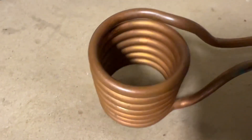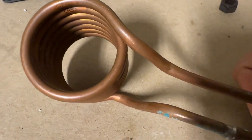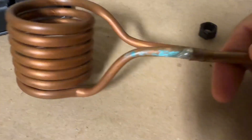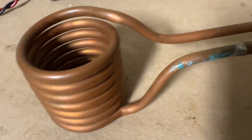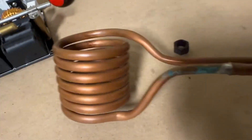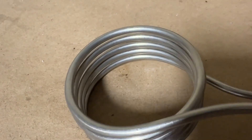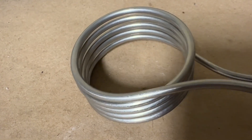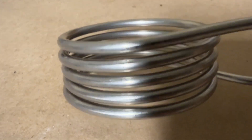What if we remove this copper coil and instead of using it to heat a piece of steel, what if we replace the coil with iron and let the coil heat itself up? That way, if we pass hot water through the coil, we would have a source of instant hot water while the coil was operating. The coil itself would be the workpiece — basically acting as both the workpiece and the induction coil at the same time.